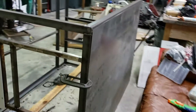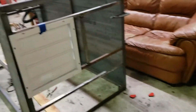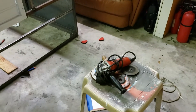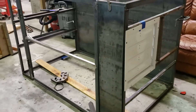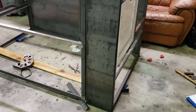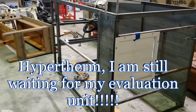I've got the largest piece cut for the back. I struggled a little bit initially on how to cut that. I've got a 4x6 bandsaw, a grinder, and a chop saw, but I don't have a plasma saw or anything like that. I started out using the grinder, but that was going to take forever and didn't feel very accurate. I watched a couple of videos about cutting thin metal and one of the recommendations was a jigsaw — basically just put a straight edge, measure it out, and run the jigsaw right along. Got some brand new blades and it works pretty good. It takes about 10 seconds to get through an inch — so about 2 minutes a foot. I would much rather have a plasma torch, but it worked out fine.